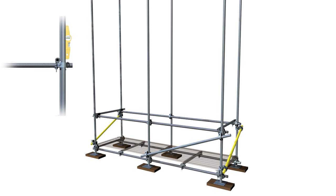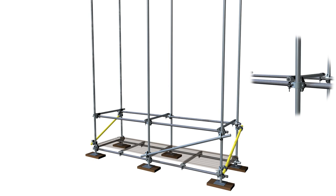A face brace is required at a ratio of 1 in every 6 bays of scaffolding. Transoms are now installed on top of the ledgers using putlog couplers, otherwise known as singles or clips, and the process begins to level the uprights along the transom plane using ledger bracing.